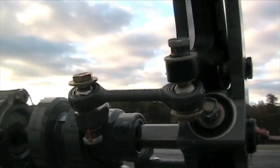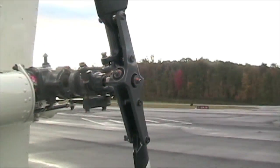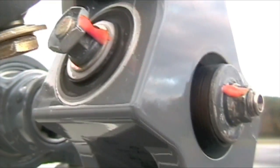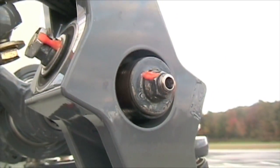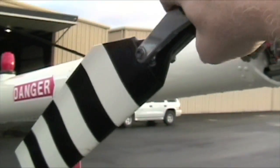Here's your teletemp for your tail rotor gearbox. Coming around, check the torque stripes. Here are your tail rotor pitch links — once again checking for twist but no lateral or vertical movement. Here is your elastomeric bearing, which is basically what holds this tail rotor in place. The old Betas had just a teeter hinge; now they use this rubber to keep it in place. Check to make sure there are no cracks, the bolt is nice and tight, and the rubber is in good shape — because if this thing starts flapping you don't want it making contact with the metal.